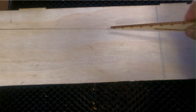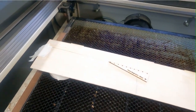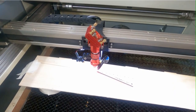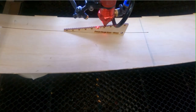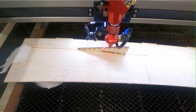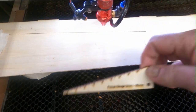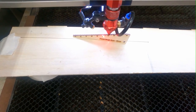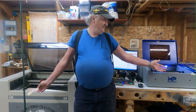So I'm gonna mark this with a tip — I don't have my pencil with me. Now I'm gonna move my laser right over top of where we need. Right there. You can see this one comes in at about 21 millimeters, and that's about right — I've modified this laser head to make it more user-friendly for me. See how easy that was? You don't have to try to measure that distance or estimate it — you just slide that right in there and there you go.